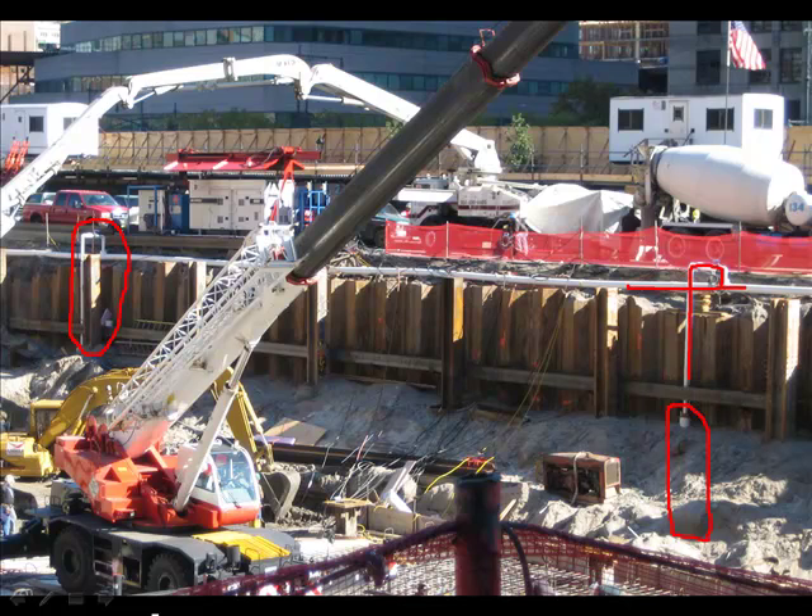Deep wells move a tremendous amount of water and can lower the water table significantly. One of the drawbacks is the cost of operating a deep well system. On a construction site, if you use a pump it must be manned by somebody — a pump man or pump operator. A pump operator can operate several pumps, but beyond a certain limit, which might be four to six pumps, you would need a second pump operator. On this site there are many many pumps, probably requiring multiple pump operators being paid around the clock 24-7. If you do the math and include all the overtime, you'll see that that is a huge expense. However, if the project demands it, that cost has to be built into the cost of construction.